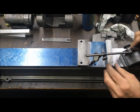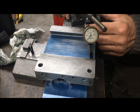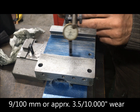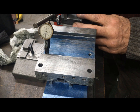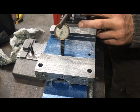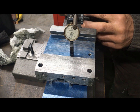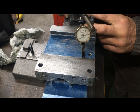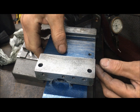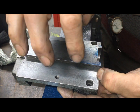To find out how much wear, I set it to zero at the non-worn area, and you can see here nine hundredths wear. Going along the length of the piece, it zeros again, then it's like five in the middle, zeros again, like six, zeros again, seven — so it gradually becomes more worn toward this side, which is normal because that's where the tool pressure is.